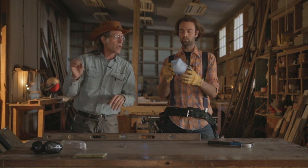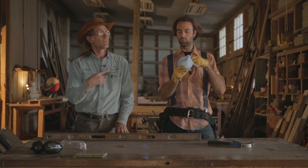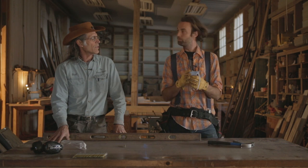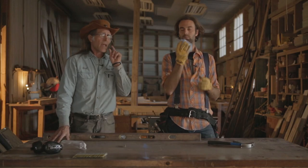This is not a comprehensive tool safety course — this is a quickie. If you have any respiratory issues at all, you must have one of these masks. This is a really good quality one with ribs; I recommend writing your initials on them so you know who left them around, because they're expensive — a couple bucks a pop. I like the ones with two straps: you can loosen the top if you don't need full protection. The hard-molded style fits your face much better for a really good seal. The next level up has a valve, which lets you not breathe in any particulates and avoids fogging your glasses — if you wear glasses, mask fog is a real problem.